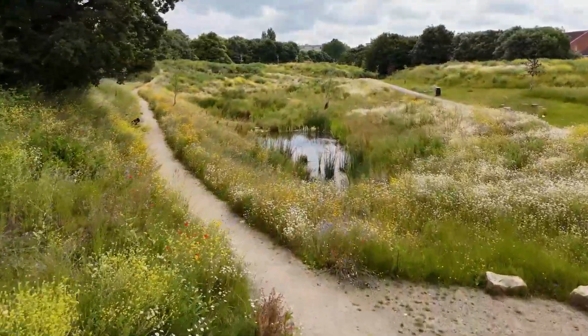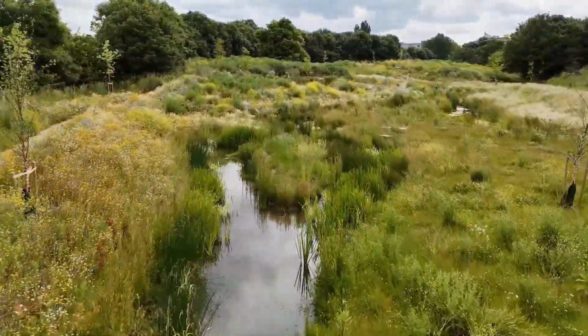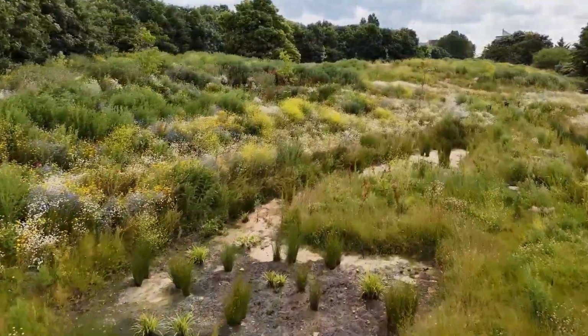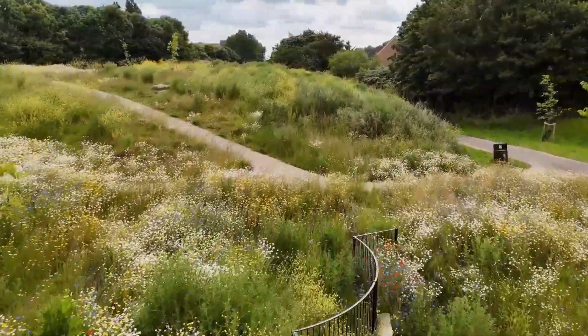Wilbury Way was identified as a pivotal site for mitigating flood risk within the Pims Brook catchment. The wetlands are fed by diverting a surface water sewer and newly installed land drains into a series of wetland cells. These cells rely on infiltration but also have an overflow back into the Pims Brook. A bunded footpath also provides additional flood storage during large rainfall events.